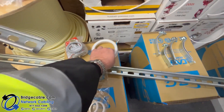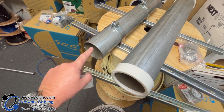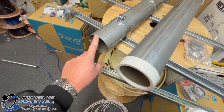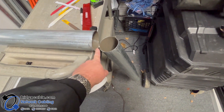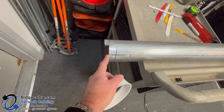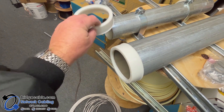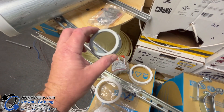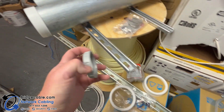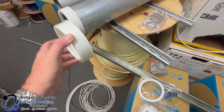I wanted to show you a couple of different things with the bushings, because a lot of times we'll see people just put the pipe up. But when you're pushing the cable in, you're going to shred it, and depending on how the pipe was cut, some cuts are nice and some are not. You have the push-on bushings — this one is for a four-inch, this is a three-inch pipe. At any local hardware store they'll try to give you screw-ins, which need another attachment. Typically we just go with the Arlington — there's an assortment of fours, threes, and all that.